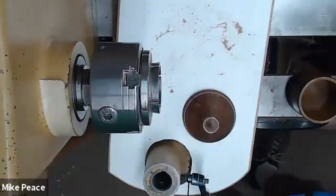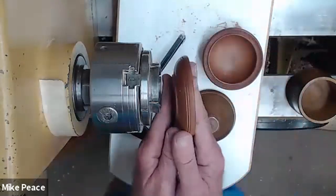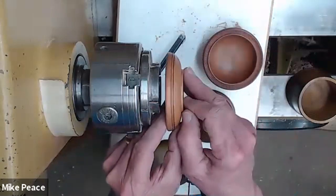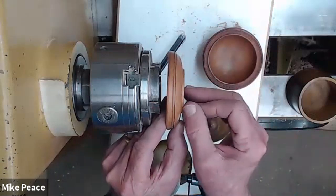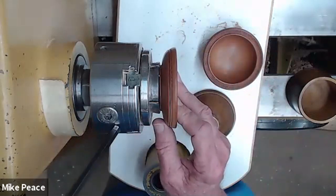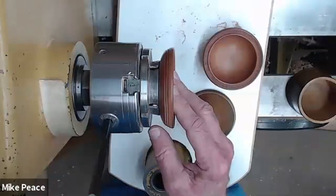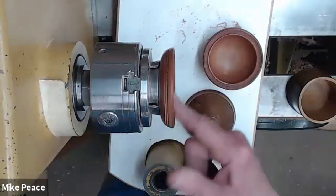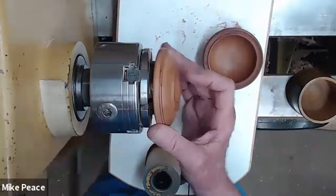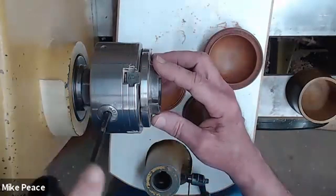And that's because he has 11 chucks. But here's an example of a little saucer I make to put threaded acorns on. You can see this tenon is just tiny. It's barely a 1/16 of an inch, but it's big enough that I didn't have to turn it away. I just left it on there, whereas I wouldn't normally do that on a bowl because I think it looks kind of clunky. But I was able to finish the inside and decorate it because I turned it with the expectation of sizing this just right, and sizing it just right is important.